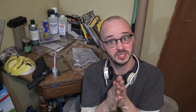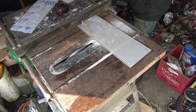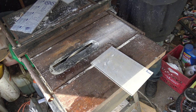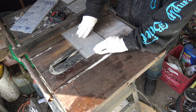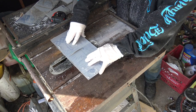When it comes to saw blades, you want a very fine-tooth blade to cut polycarbonate. Polycarbonate doesn't tend to chip like acrylic does, but still to be safe, this blade I purchased at Lowe's for $12 was rated for PVC, acrylic, and polycarbonate. You can find them fairly cheap, and you want to invest in a nicer blade if you're going to be cutting a lot of plastic.